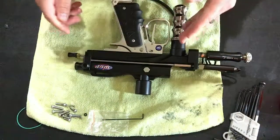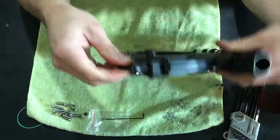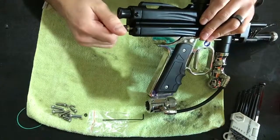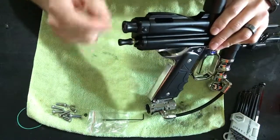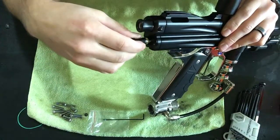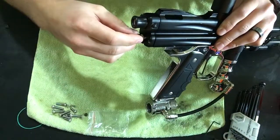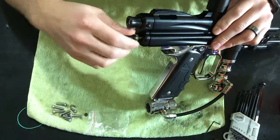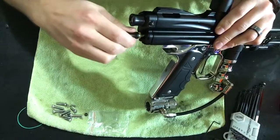The last one I'm going to talk about here has to do with the cocking rod. Keeping the cocking rod in place is a pretty easy one. Basically, you take a bit of pneumatic hose and snip maybe one to two millimeters off, and drop that into the back of your hammer where the cocking rod threads in. Then you can screw the cocking rod in and snug it up and it'll stay tight, because if it's got a hard stop at the bottom it's going to loosen up. A lot of times you'll notice your cocking rod will come loose over time. This will keep it nice and tight, only come off when you want it to, and you can do it hand tight instead of having to get on it with a wrench.